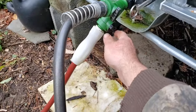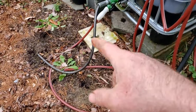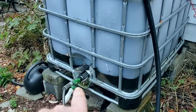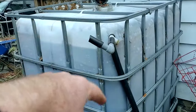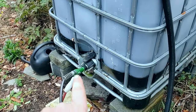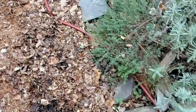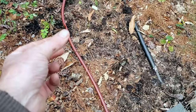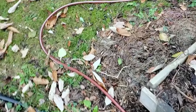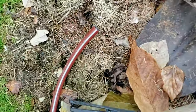What I'll do is turn this valve, which will allow water to flow through the red hose, and put the red hose out in a meaningful way. Now we've got the bulkhead open from the tank. If rainwater comes in — say we have a thaw with an inch of rain above freezing and then it freezes again — it can freely flow through this red hose. It's a junky scrap hose we found on the side of the road, but it works fine enough. It comes much further away from the house, which is the important part, and can freely drain out.